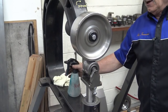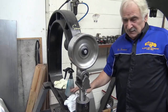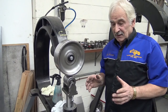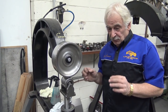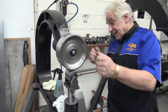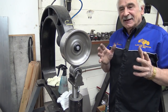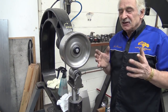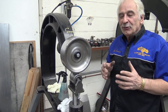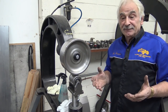Now, I'm going back to, I think I mentioned that before. This primary wheeling is very important. Don't rush it. Take your time. Because you can't afford to yank it too hard, or wheel too much on it. If you remember, with the gauges, the guard was pretty close. So realistically, all you need to do is feel the lumps and get rid of them, because you're not really stretching it that far. It's already been stretched. All you're doing now is smoothing it off.